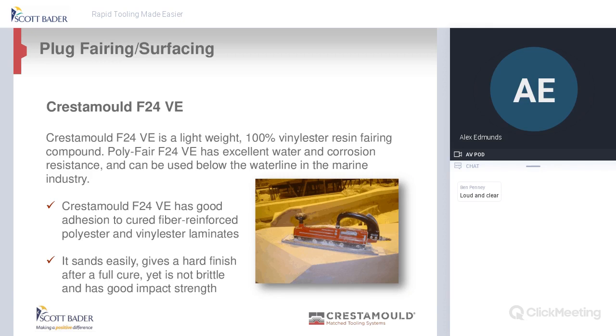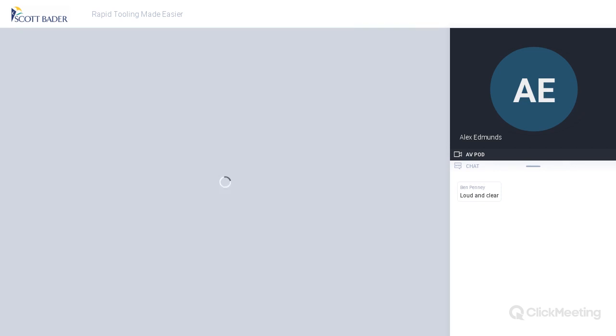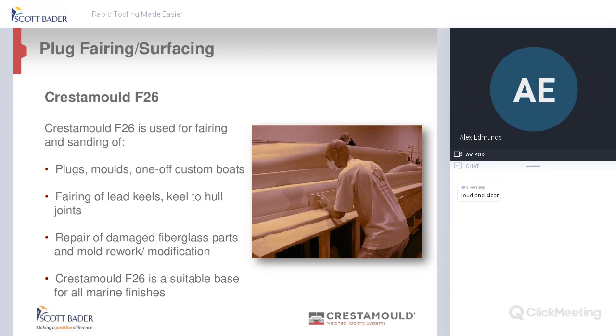Depending on which product you use, if it's the F24, it's a 10-minute gel time, and the F26 is a 3-minute gel time, but it sands down really well. And it's a great product. It really is a great product. Every workshop should have one. So the F26, as I've said, it's good for plugs, molds, one-off customs. You can use it anywhere, and it can be used for repairs as well, for fiberglass, for the parts.